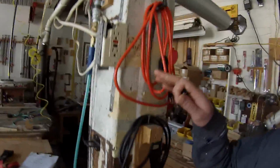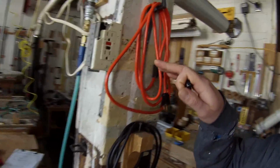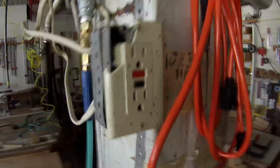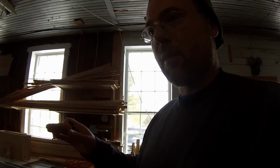You can have electrical problems because that really fine dust, which is essentially like smoke, can permeate these spaces inside of electrical boxes, inside of your outlets, and then it can gradually build up a little fine layer inside of there, and then in higher humidity conditions you can get a short circuit. And if you have any grounding problems in your electrical system, then you have the fire risk associated with ground faults and sparks. So that's why malfunctioning dust filters or malfunctioning systems can create such a hazard.